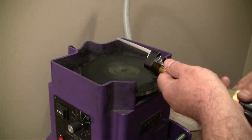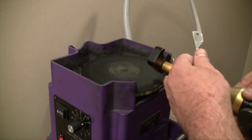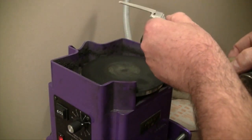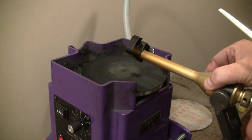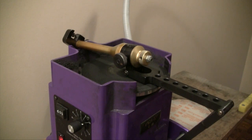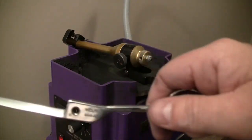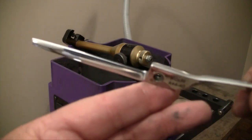I'm doing my polish, making sure I get all the way to the tip and all the way to the throat, doing about 20 to 25 strokes back and forth, then lifting straight off and shutting the machine down. I'll remove the blade from the fixture — one important point: always take it straight up and out. I once made the mistake of dragging the edge across the inside of the clamp by accident and had to reshoot an entire 20-minute unbroken segment. So we've polished up the edge, wiped it down, and you can see it still has that slight bevel on it. We are ready to go put this back together and do our test cuts.